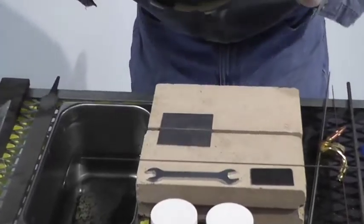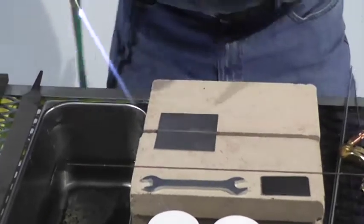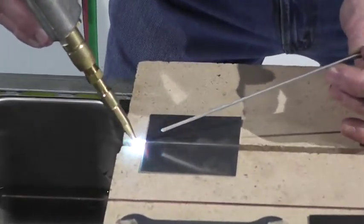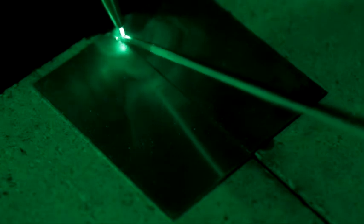You also need a special pair of glasses to weld aluminum. Now, always take that cone down and just sort of preheat that metal a little bit. The larger or thicker it is, a little more preheat — get the aluminum where it's just starting to melt and push the rod in.